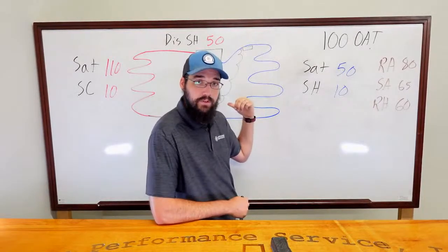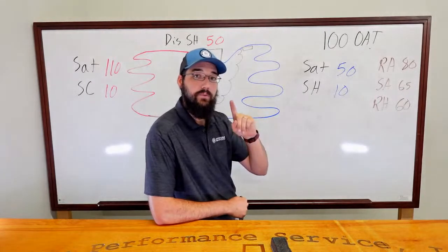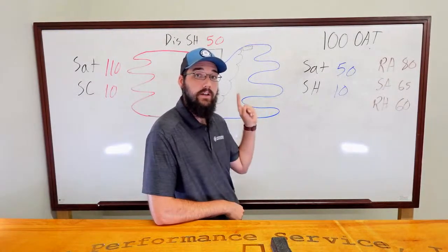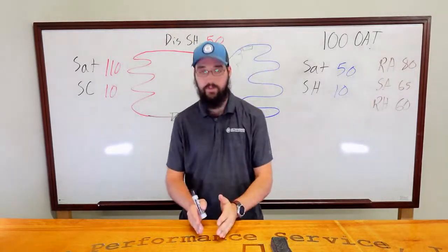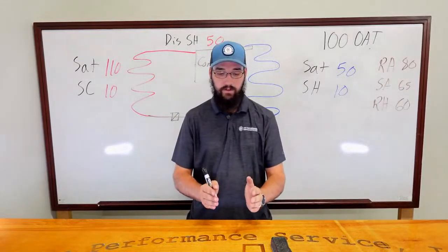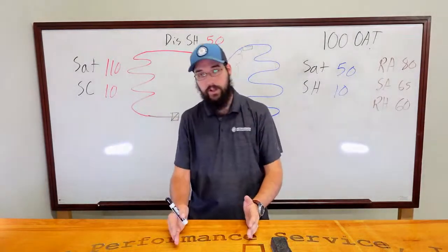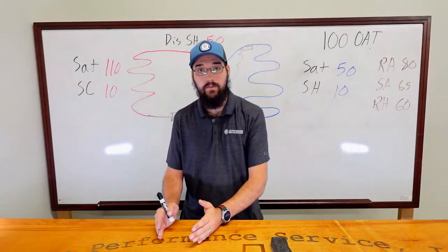But by the time you put this new compressor in and you go to start it up, then you get into the second phase of your troubleshoot, which is why did the first compressor fail? And I would have that question at any point. You lose a compressor. I've talked about this heavily. Your first phase of your troubleshoot process is, is the compressor bad? Once you've got that far, after it's changed out, your next phase of that process is, what took it out?